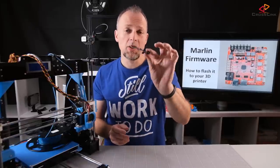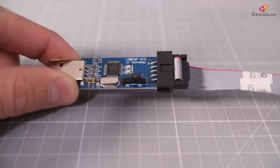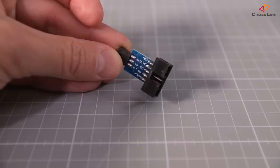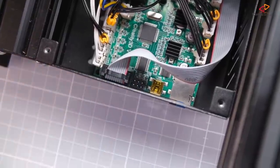Let's start with the first option: the USB ASP programmer. It's a tiny USB stick-like adapter that plugs into your USB port, and on the other side it connects to the display cable, and then you need an adapter from 10 pins to 6 pins that plugs into your mainboard. For the Anet A8, the programmer uses a different pin layout than the connector on the mainboard, so you need to use this adapter — otherwise you will simply fail uploading the firmware. On the Ender 3, it's more obvious that you need the 6-pin connector, because there is a 6-pin counterpart on the board for attaching the programmer. The USB ASP plus adapter package will cost between $9 and $13 on Amazon — links are in the description.